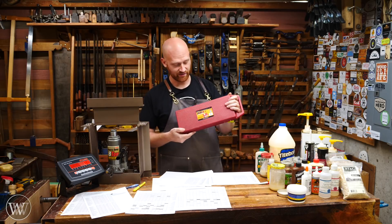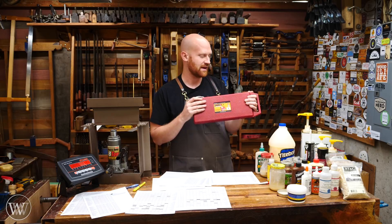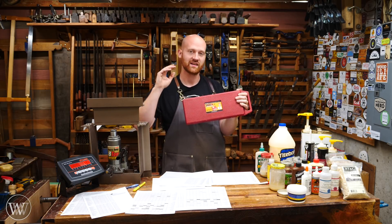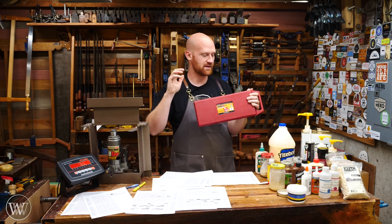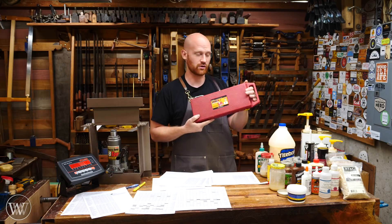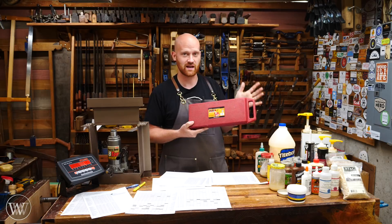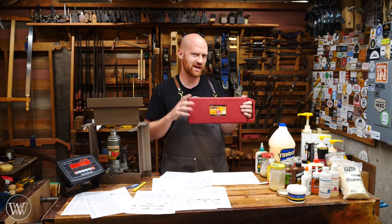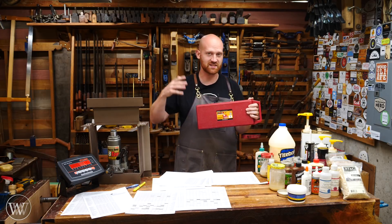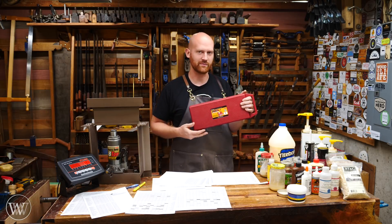Next up, we have the 2P10 glues — basically a super glue, a cyanoacrylate. They did surprisingly well, particularly the gel and the thick glue, holding their strength for long grain to long grain. I am going to be using these far more. The one question I have is how they will last over the long term, so I might be doing a long-term study every 6 months for the next 20 years to see if they stand up.